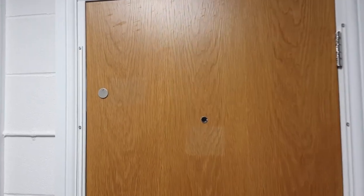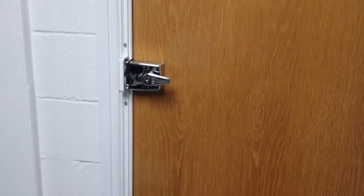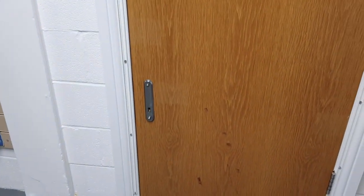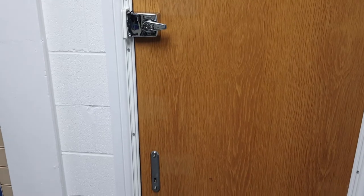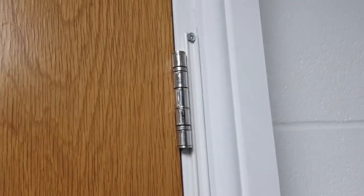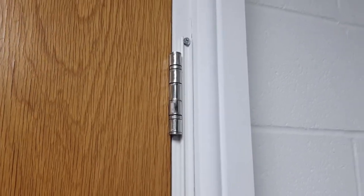Once all this work is done your door looks very secure from outside. One important reminder: you must actually lock all the mortise locks — we fit these on many doors and people don't use them. Lock everything 24/7. A burglar seeing all this security on the lock side may instead target the hinge side, kicking the hinges because they're normally held by only a few short screws. Those hinges can split out of the door on that side.